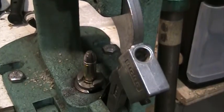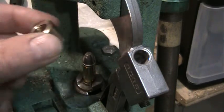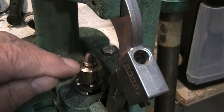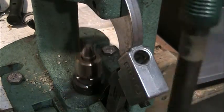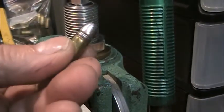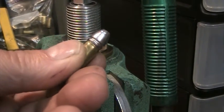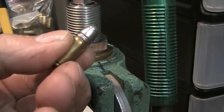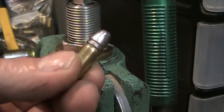To operate it, I've got a bushing I made up here of the correct size. When I slide it over the top of the bullet and push it up in there, the face of the collet is pushed by this bushing and tightens it up. The neck pressure is going to be the same on all of them, so I'm hoping this is going to straighten out the issue with the erratic velocity.